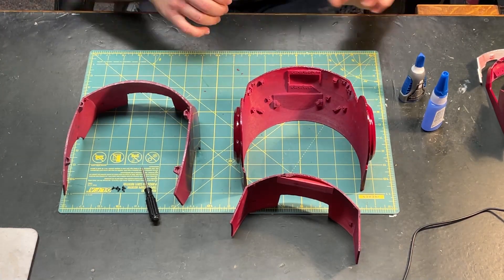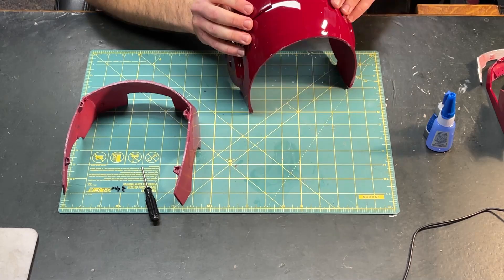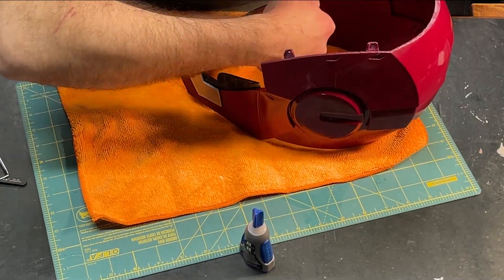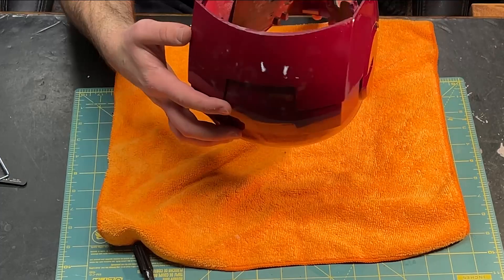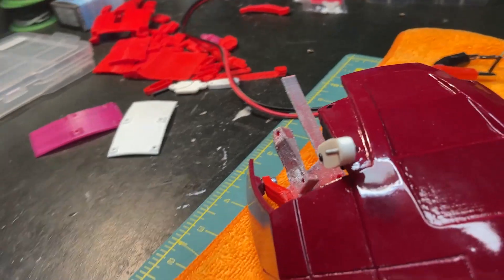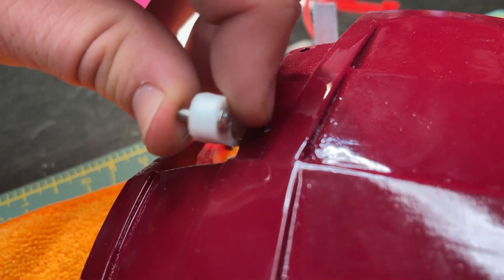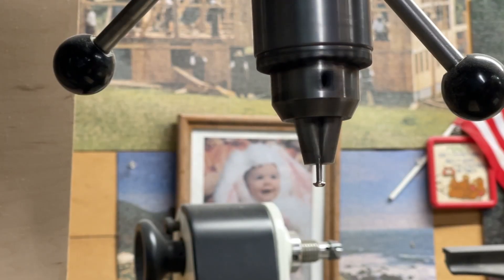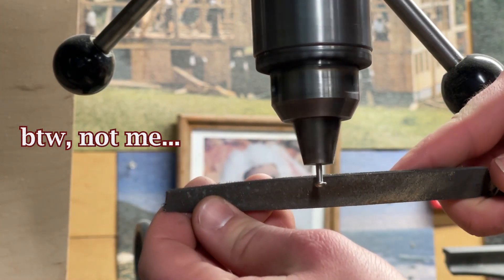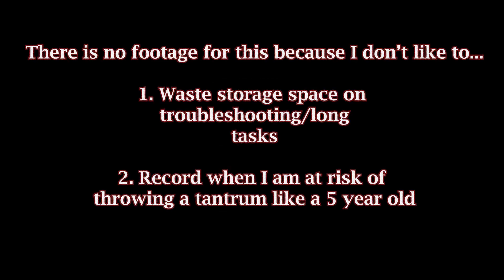Back to assembly — I secured all the dome parts with super glue. When gluing glossy surfaces, consider roughing up the areas that touch for better adhesion. Honestly, I meant to but completely forgot, and it seemed to work alright, so I'll take it. Now for the really fun part: attaching all the motors to the faceplate. I was putting together the linkages, but one bolt was pan head instead of the required countersunk, so I chucked the bolts into the drill press and filed them down to size. I ended up having to open up and countersink the holes on multiple arm pieces as well.